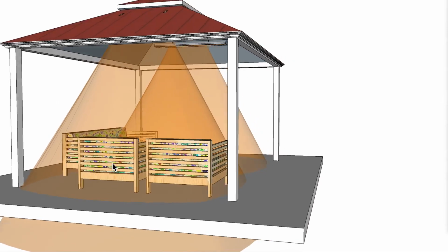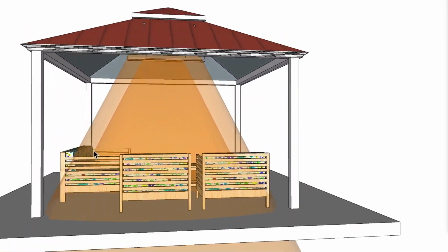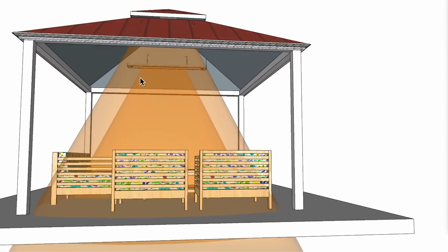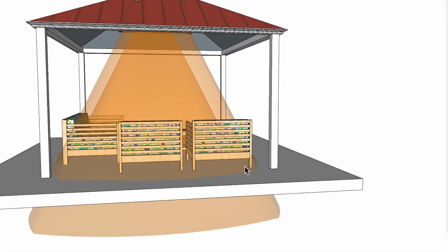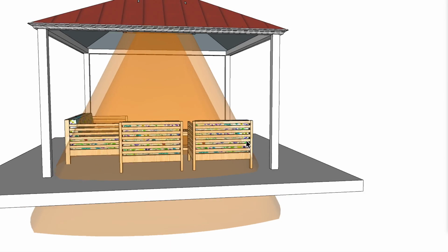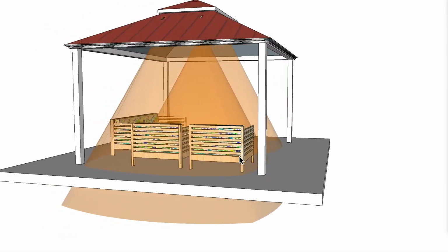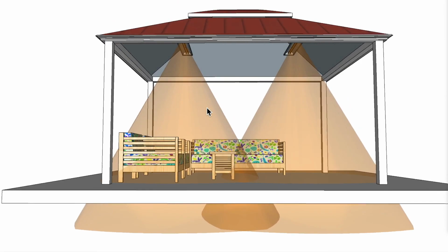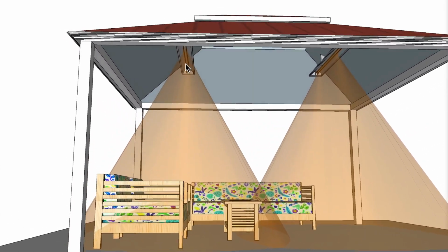And the other thing about the 5024 compared to this 6,000 watt unit here is, with the 5,000 watt unit, they're 39 inches long. These are 61.25 inches long. So the footprint of heat is a little bit narrower on the 5,000 watt unit. So I'm trying to get as much coverage from left to right here. So that's why, if I was going to do any of those two, I would choose the 6,000 watt unit. And you can see that I placed them right here roughly.